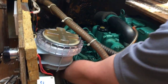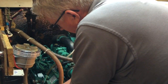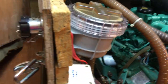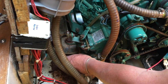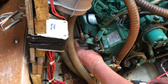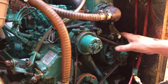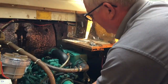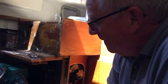The oil filter isn't an absolutely easy one to reach — the side boxing really wants to come off to actually get to it easily. Engine mounts generally should be changed at the same time as when you do your donut on your sail drive. If you haven't got a sail drive on your normal shaft, then look at these every 10 years. As you can see, there's a lot of corrosion on this support bracket — there's been quite a bit of thinning on there. Always look at the fastenings and the bolts; I quite regularly find that a few bolts come loose — when you can turn them with your hand, you know you've got a problem. At least we know after two and a half years it hasn't seized, which is a good sign.